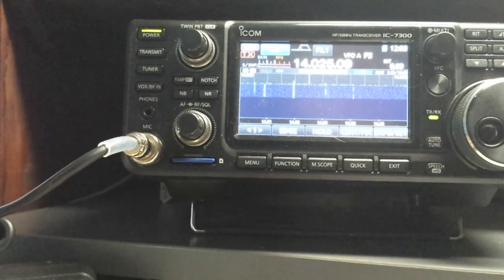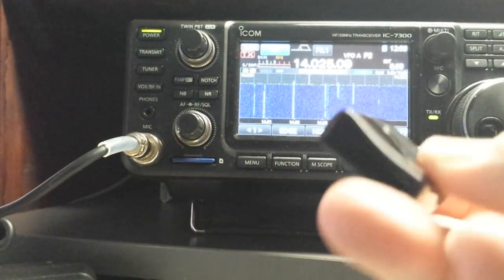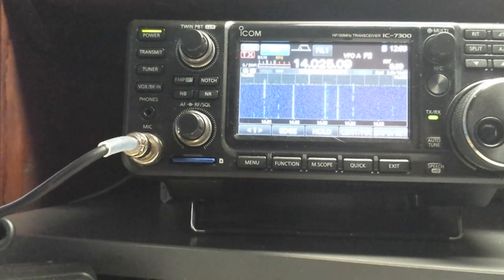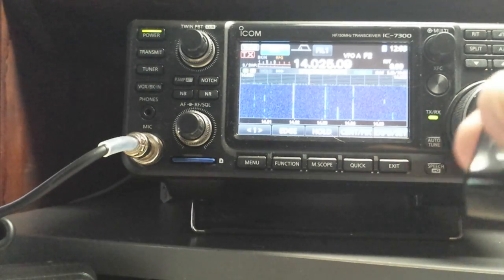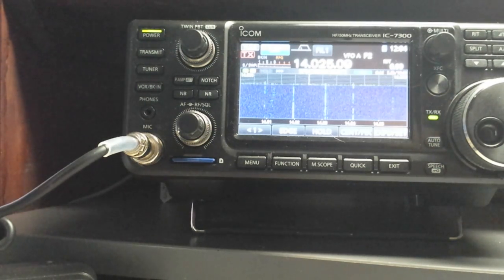That's all there is to it. I'm going to put some silicone back over it and put my little cap back on. You don't really have to have that, but it's a neat feature. If you go to eBay and search for ICOM Remote Tuner Plug — or just ICOM Tuner Plug — you'll see several options. You can actually order the plug and the pins and this little cap from a guy for $8.95 — supply your own capacitor and resistor. It's probably the best way to go. The other guy, W2ENY, is where I got this, and it was $10 plus shipping. 73.